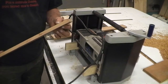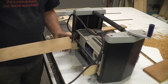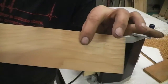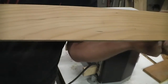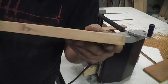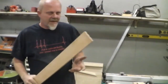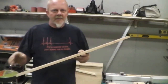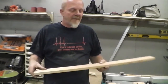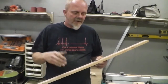This piece was just a little too thick to be running through — it should have been run on a pass of its own. But even so, even on the exit, no snipe — none. I can't demonstrate it any clearer than that. I don't care if you've got a 30-foot infeed and outfeed table — that is not what's causing your snipe. What's causing your snipe is that head rocking. This eliminates it.